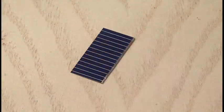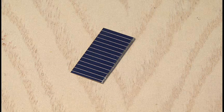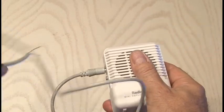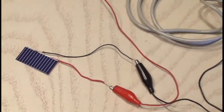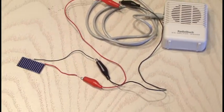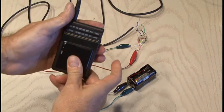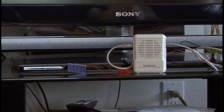To build the receiver, we need a small solar cell — this one maxes out at only a half volt, but it'll do the job for us. Just a word of caution: these little solar cells are very delicate, so handle them with care or they'll snap in a heartbeat. Now we're going to plug an audio cable into our mini amplifier, and that audio cable will have stripped ends which will attach to the positive and negative wires that we soldered to the solar cell. And now it's time to test it out — we're going to use a little transistor radio, plug our connector from our transmitter into the radio, and set everything up and see how it works.